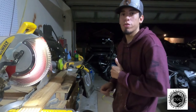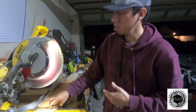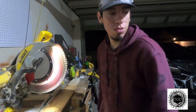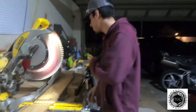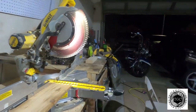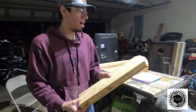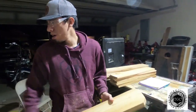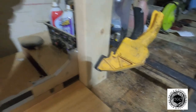The next step is to create the front and side parts. We're going to cut 26 inches — cut 26 inches twice out of one board. Don't throw away the scrap; put it to the side because you're going to use it for the side pieces. Get two cuts of 26 inches out of each board, and we're going to be using four boards total. Then use the scrap pieces and cut those at 15 and five-eighths inches. Cut four of these using a stop block and fence.